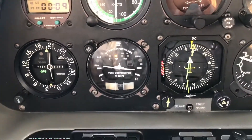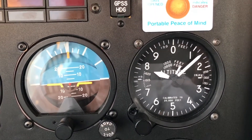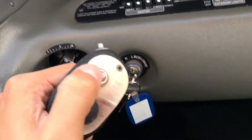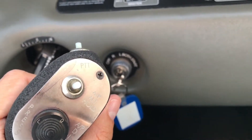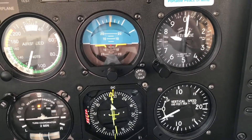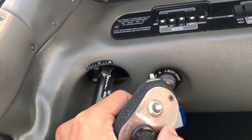The other mode available on this autopilot is the altitude mode, and that mode is pretty simple to use. I'm gonna use an example — I'm currently at 8,140 feet, so I'm gonna descend to 8,000. As I reach that altitude, I'm gonna use a button here on the side stick that says 'autopilot altitude hold.' Let me descend to 8,000 — almost there. When I hit 8,000, I will level up the aircraft and hit the button. There we have 8,000 — almost there, there we go. I'm gonna hit the altitude hold button.